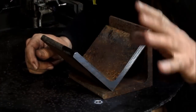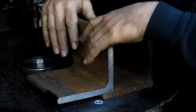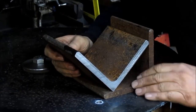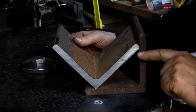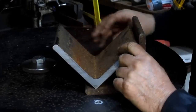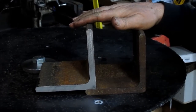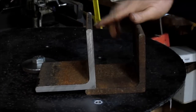Basically we're going to make a V-block here. It's not going to be a precision V-block because all we're doing is putting eight-inch pipe into this V and gripping it and drilling a hole in it. As you can see, I've got two pieces here and what I need to do is just cut the top off of this one and trim it so that I can get it underneath the V of this part here. I think we need six of these cut, then we'll go ahead and cut the tops off and keep working.